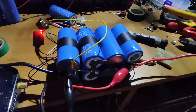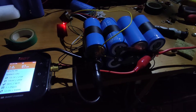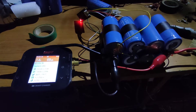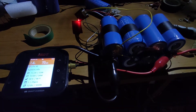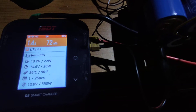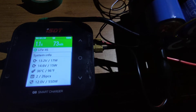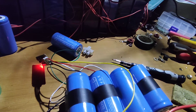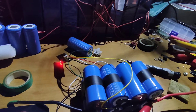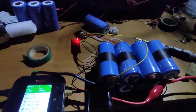With time it'll probably even them out fairly well. One of these cell groups could be at around 3.75V because they tend to shoot up pretty quickly towards the end of the charge. It's at 14.6V on the charger but we're still charging at a low amperage - and it's decided to finish. The balancer is still going, meaning one cell is still pretty high and it's trying to bring it back down.